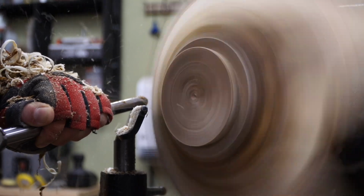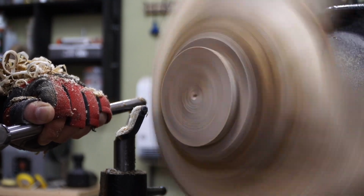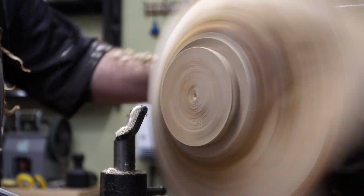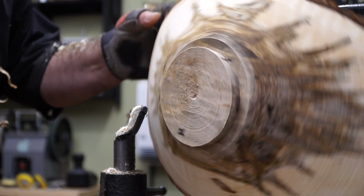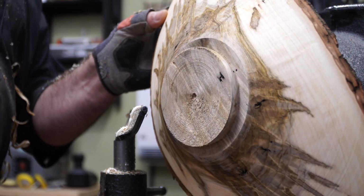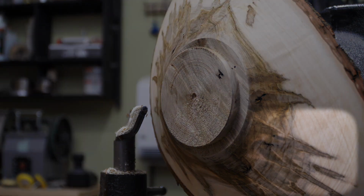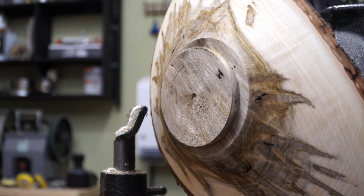Here I'm cutting air, so this got nothing to do with it. It was just the bit prior to it. You will see when I stop, and I couldn't figure it out before why I was getting lines when I thought I was smooth cutting, but as you can see, I'm gonna highlight here where the lines are. That's exactly where I was basically rubbing the bevel instead of riding it. And yeah, that's how we learn.